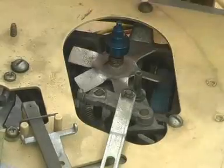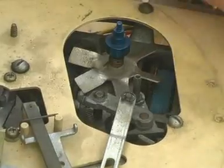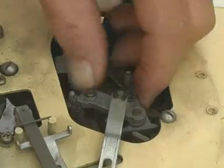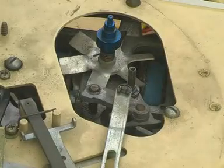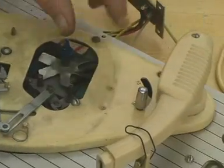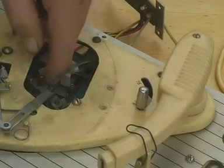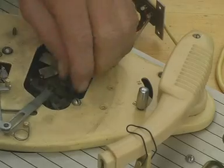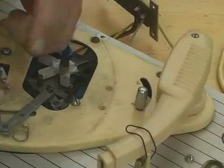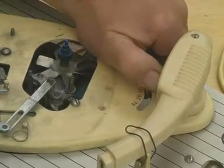No, the selector still doesn't work — there must be something underneath that also requires attention. It seems to have jammed. I'll go back to the drawing board. Yes, everything's okay now. This thing which rises up the idler wheel — the shaft goes underneath. I can't show it to you because it's right hidden away, but this shaft is a fork and it's on either side. It was the bottom half that wanted lubricating as well. But now the speed selector works.